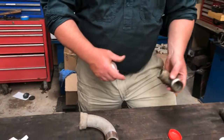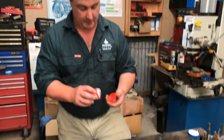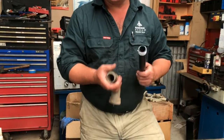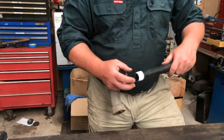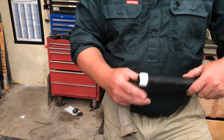Once again it's got Teflon in it. The idea behind having Teflon in the tape and the rope — these fittings are all BSP-T tapered threads, and so they rely on a tapered male thread going into a parallel female thread. By putting the tape on, not only does it fill in some of the surface imperfections, but it also reduces the friction in the fitting as you tighten it, allowing you to tighten it more tightly and get a better seal.